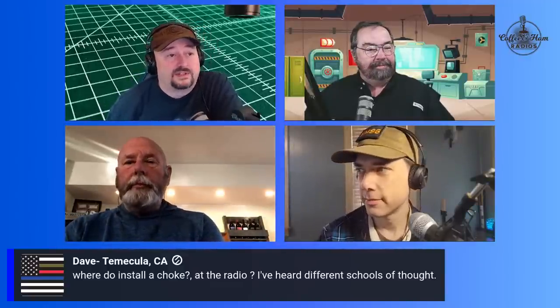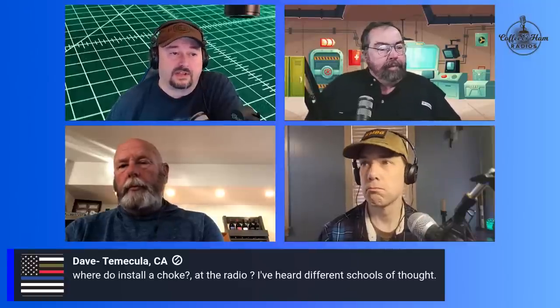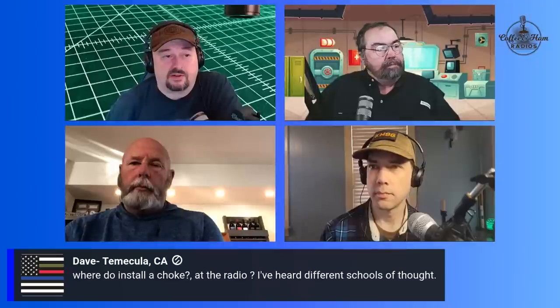So Dave in Temecula is asking, where do we install a choke at the radio? He's heard different schools of thought. The official answer is that you should have one every quarter wavelength along your transmission line for the lowest band that you're operating on. Yeah, that seems like a pain in the ass.